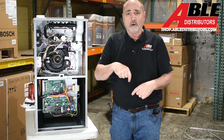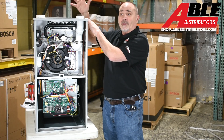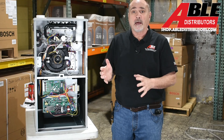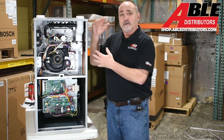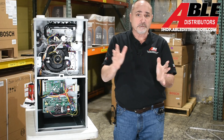If you don't pair it with a new 454 Bosch furnace, you're going to have to have an interface board. I'm going to link that video below so you know how to use an interface board, because putting that coil on a Lennox, Carrier, Trane, Bryant, or an older Bosch could absolutely happen. That interface board — covered in another video — lets the sensor talk to whatever piece of equipment you're using.